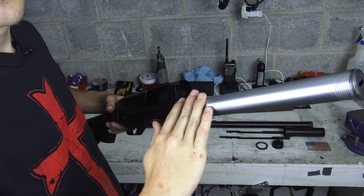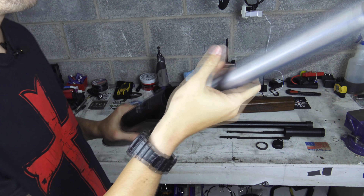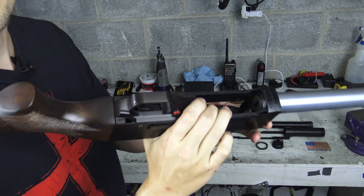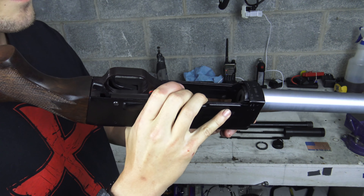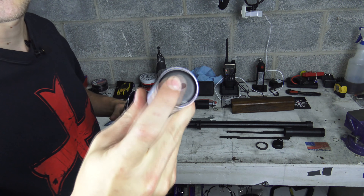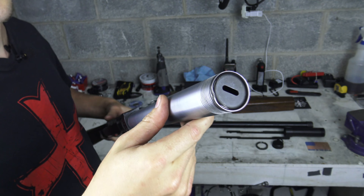Moving down the line, you've got your magazine tube, which is just a really, really simple tube, threaded on both ends. I'm assuming the same thread pitch, but I'm not going to find that out because it's secured in there very tightly, and frankly I don't want to force it since replacement parts for this are non-existent. As you might imagine, it's really no different than other shotguns — you've just got an end cap in there, spring loaded, which pushes the shells out backwards and interfaces with the receiver to stop it coming out all the way. On the other end you have the same sort of end cap, held in place by peening the end of the tube itself. Incredibly simple and pragmatic solutions for everything here.